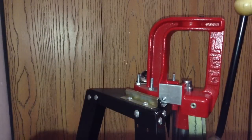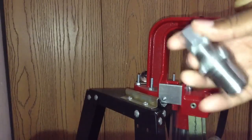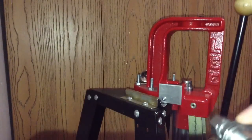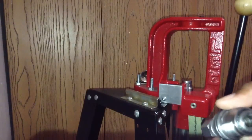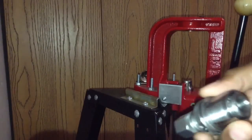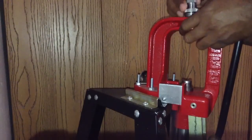At this stage we are going to flare the case mouth. Just a simple Lee die — Lee's inexpensive. I'm really a big fan of Hornady dies, actually a mixture of Hornady, Redding, and Lee. I tend to mismatch my die sets. Usually I'll have a Redding sizer, maybe a Hornady seater if there isn't a Redding seater available, and I'm a big fan of Lee crimp dies. You'll see me using those in several videos I'll probably end up making. This has already been calibrated from prior use. A good thing about these Lee die holders is you won't have to set the flare or seating depth every time — just stick the die in and it's ready to go.